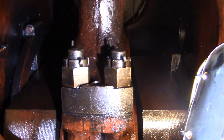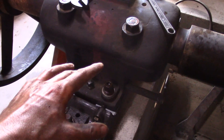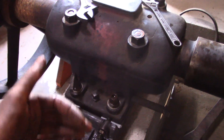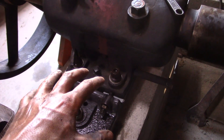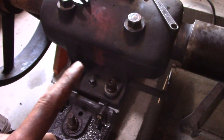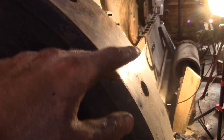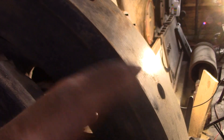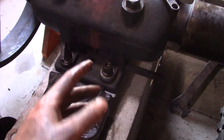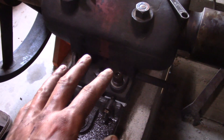And that is all there is to it. Now with up and down and side to side adjusted, I am going to tighten everything down nice and firm to the final torque that I want, and then recheck with the indicator the distortion — both up and down and side to side — to make sure that tightening these didn't adversely affect the adjustment.